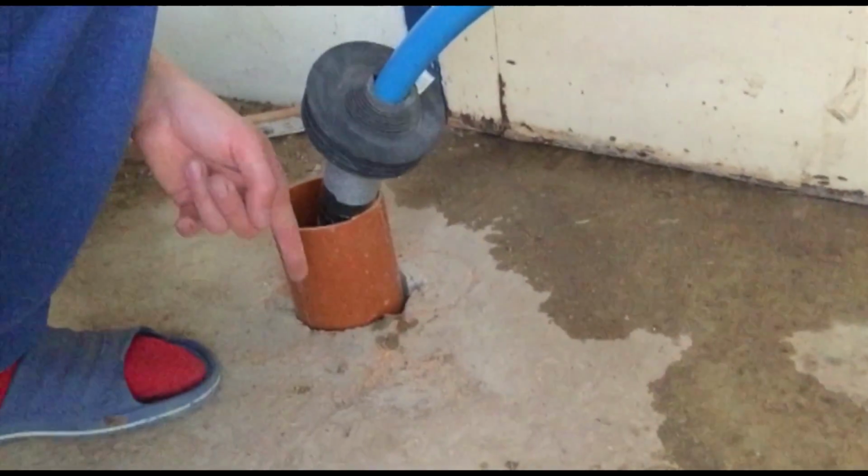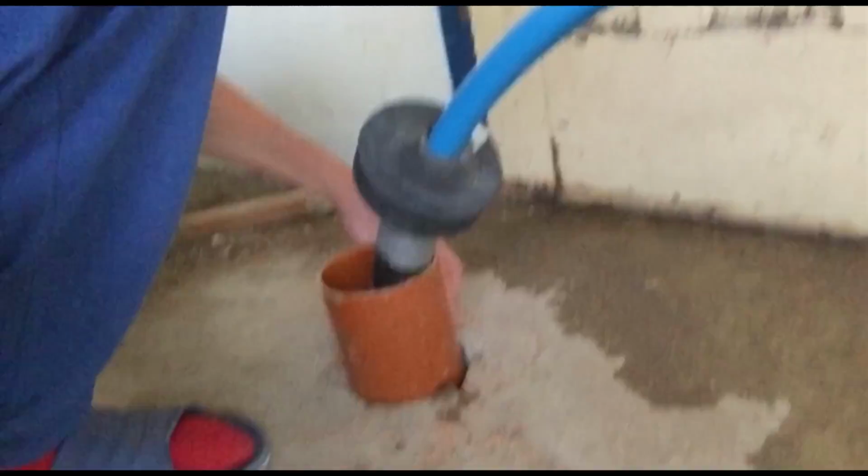So we bored it out with this, and I ended up drilling really deep holes at different points with a hammer drill to get all the way through. I drilled all the way around, because it actually needed some space for the dust to travel down, and there was less material to remove, because on those bores there's nothing like a normal drill to pull out the dust.